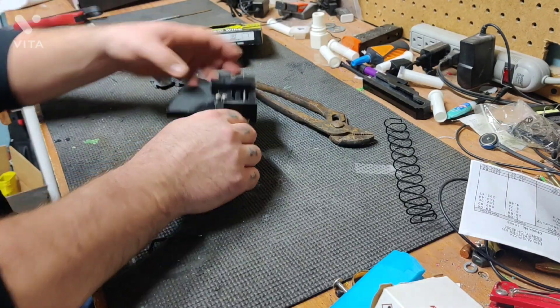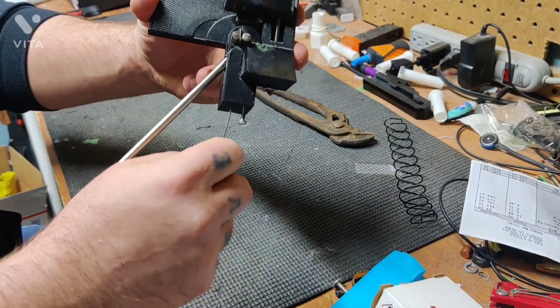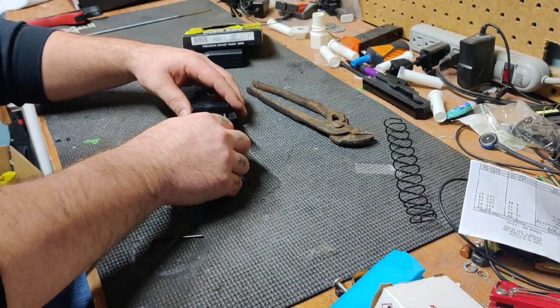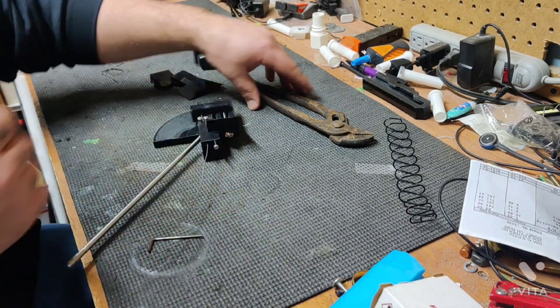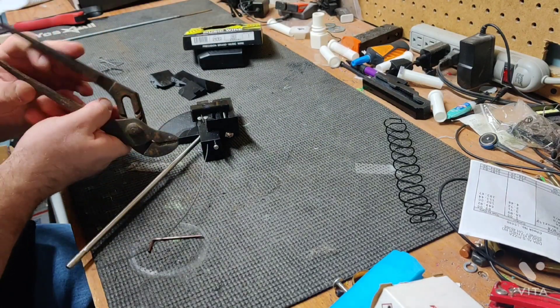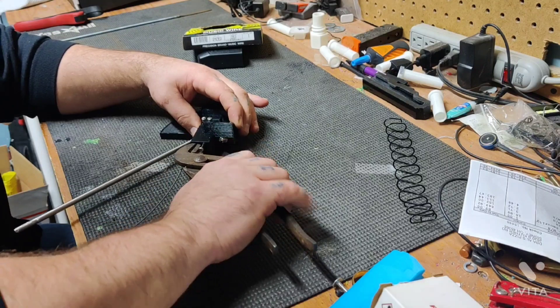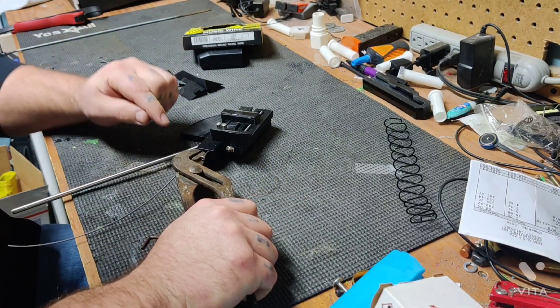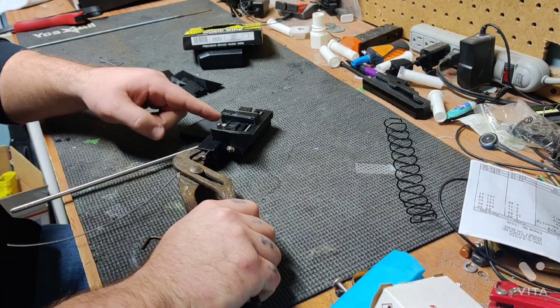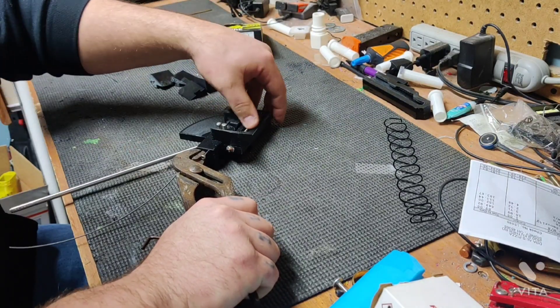You would feed your wire up in between the two pins. Ideally you'd have your stop set up and feed it until it hits the stop. Then use some kind of pliers — locking pliers, needle nose, square nose, whatever — and pinch on there to hold it in place. If you don't do this, when you go to bend it, it will just pull your wire through, your measurements won't be accurate, and nothing is going to come out the way you wanted it to.